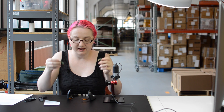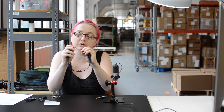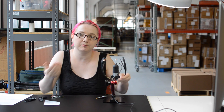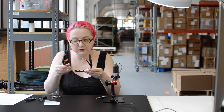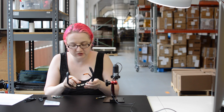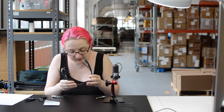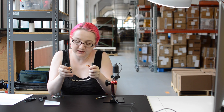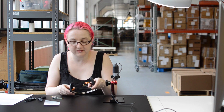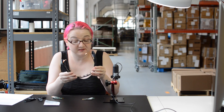Both boards have a little snap connector on the side and they plug into the two pieces. After removing the hot glue, you can see the flex circuit connects the two pieces so the battery can power the circuit on the other side — good for space, giving you two equal lumps on either ear. But this flex circuit is also used as a sensor: they used the flex circuit itself and plated it with what looks like silver. It makes sense — it's hygienic — and plugs into the circuits on either side. So this flex circuit serves for power, signal, and also as the sensor itself.